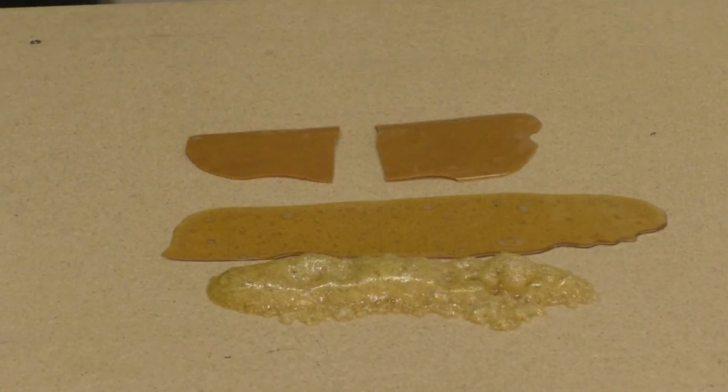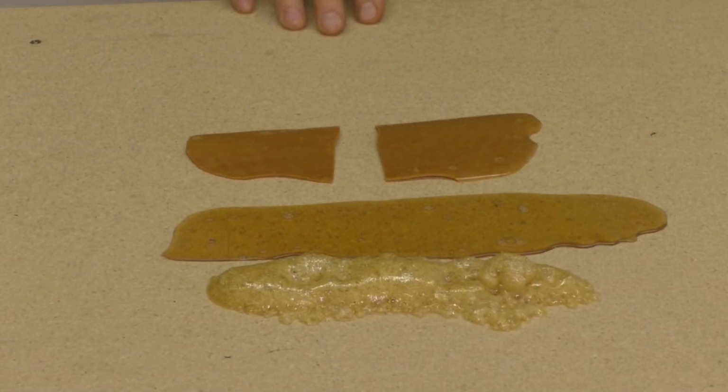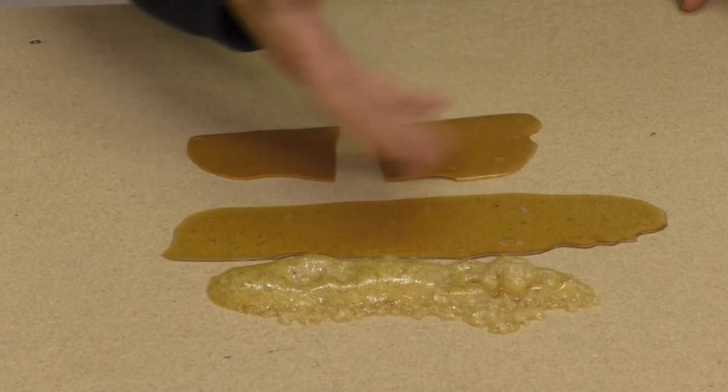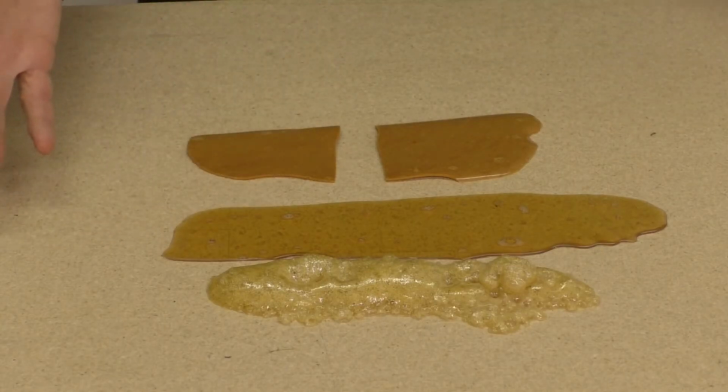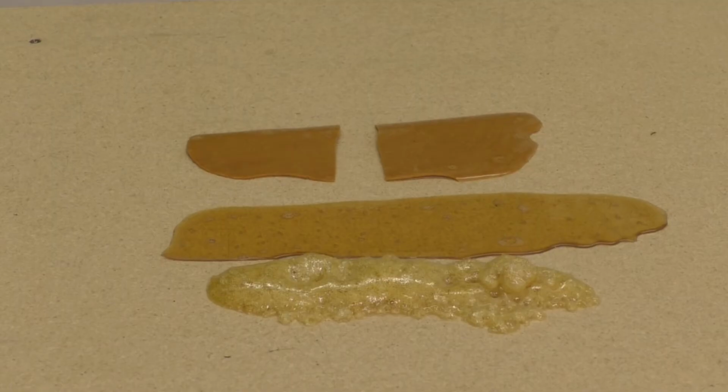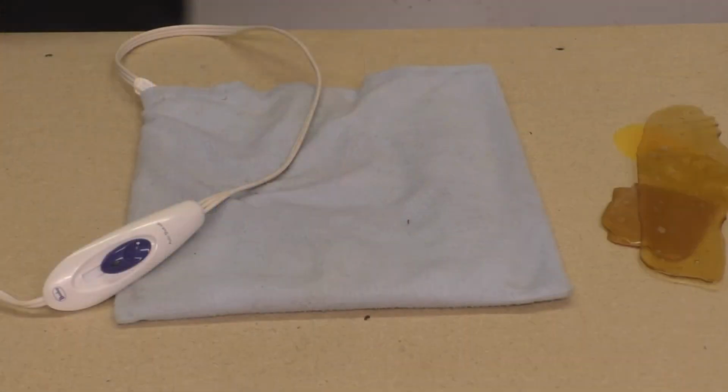Nothing compares to the rigidity of urea resin glue, although epoxy and polyurethane are decently hard. What makes these 3 glues, the urea resin, the epoxy, and the polyurethane, the most rigid of the 5 glues I've talked about is that they bond and cure by chemical reaction. Because of this, these glues, unlike PVAs, do not soften with increased temperature or moisture. Let me do this simple demonstration to show you what I mean.